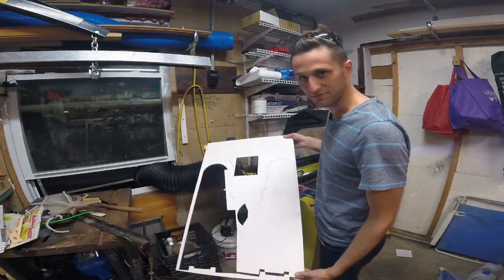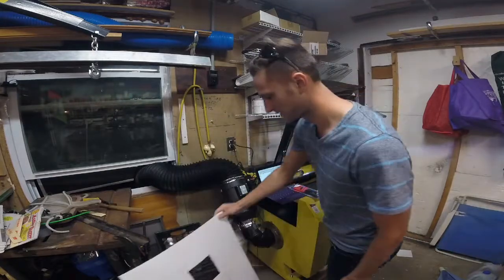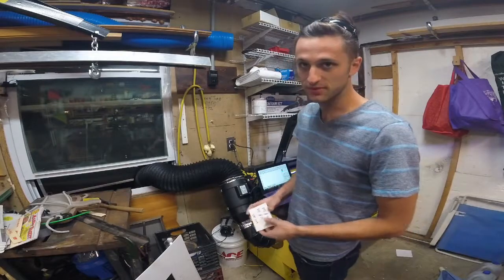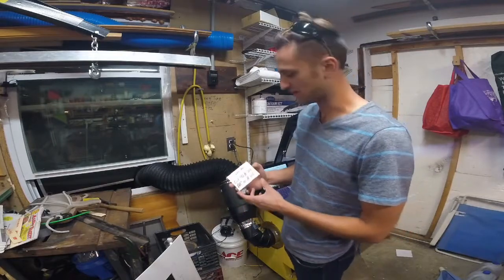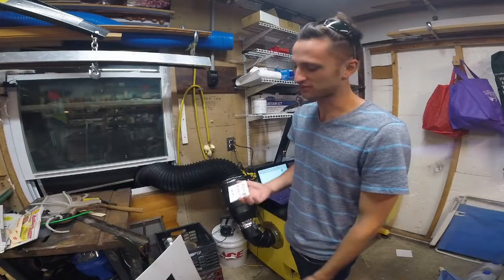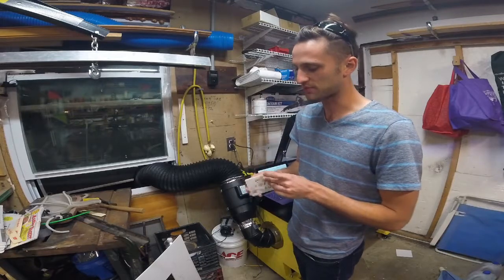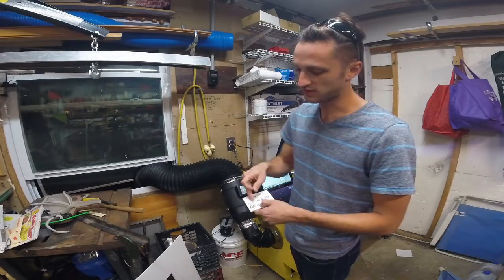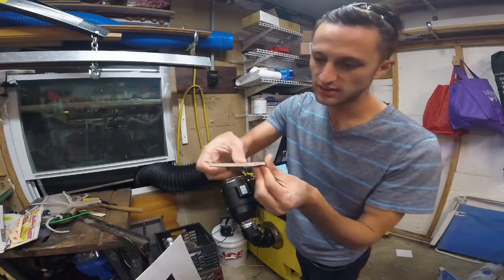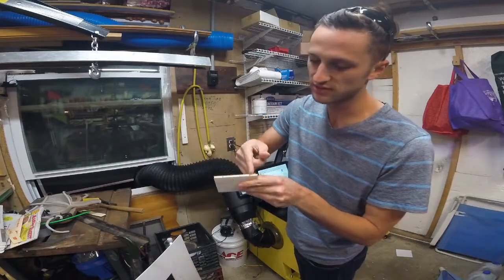It looks like it's already falling apart, but you get the gist — it's actually cut through and made all of the shapes that I wanted to get done. A side note: if you're ever using a laser cutter, what you're going to want to do is make a practice piece and dial in all of your settings so that when you go to do the real thing, you don't mess up as much. I took a piece of regular foam board and tried out different speeds as well as power settings to find out which worked best. I did a perimeter cut and then inside for etch, because you can see here how it made it through the top part of the foam board but not the bottom part — and for a lot of the Flight Test planes, you need that specific type of cut.